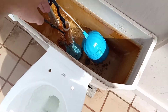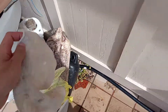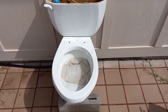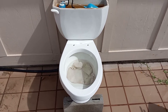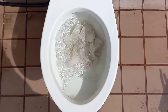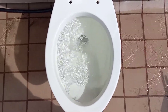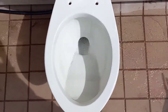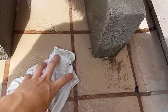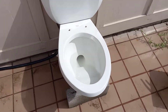I'm going to add some water to the bowl and then try a washcloth. Unless there's something like a toothbrush, razor blade, or toilet cleaner in it, I'm 100% sure it'll pass. I just have to wait for the tank to fill up. That was a perfect pass. It looked like it struggled, but that's just because it still had to fill the bowl up a little and it was already at the trapway opening before it started siphoning — so it looked like it struggled but it actually didn't.